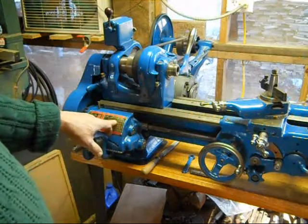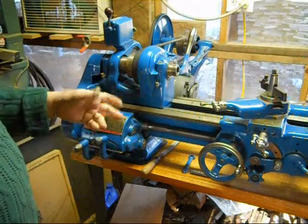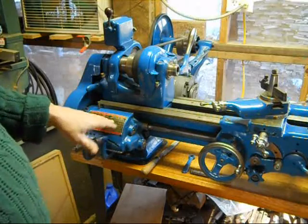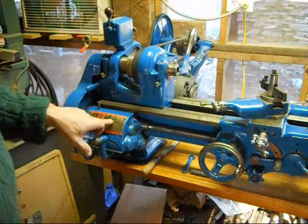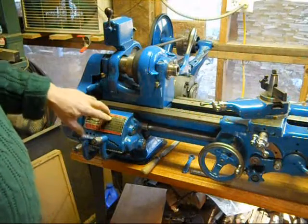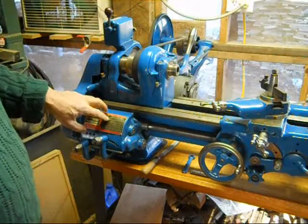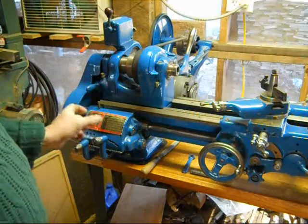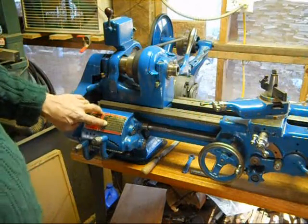Well, on the first 4, you've got that dowel pin going through them that locks them in place. So once you've lined up the first one, you've lined up the 4th one, and the 2nd and 3rd one, conversely. The last 2 are the 22 tooth and the 18 tooth, and it was the 22 tooth that I broke, or the 18 tooth, I'm sorry, I broke the 18 tooth. And then this very last one is the one that has the long gear that has the tapered pin that goes through the shaft. It doesn't have the keyway on it.